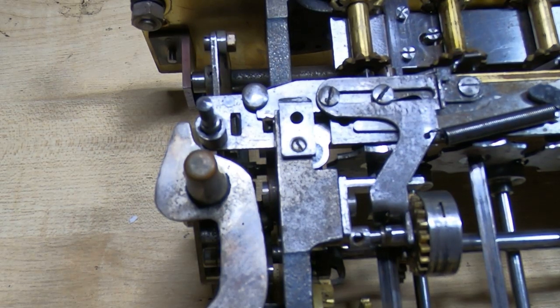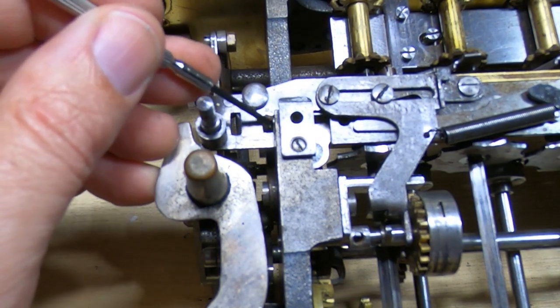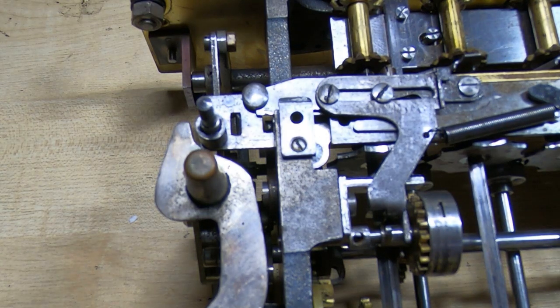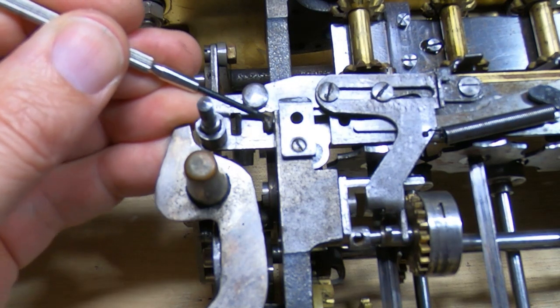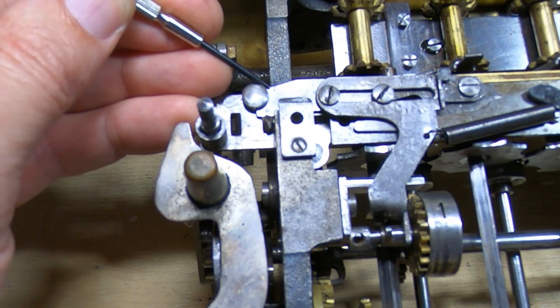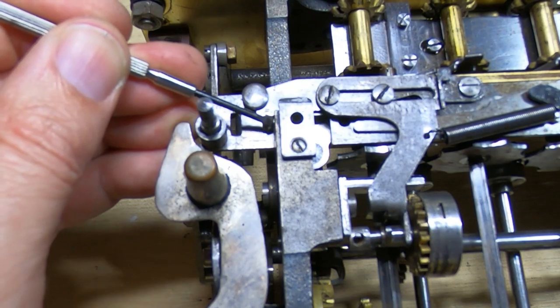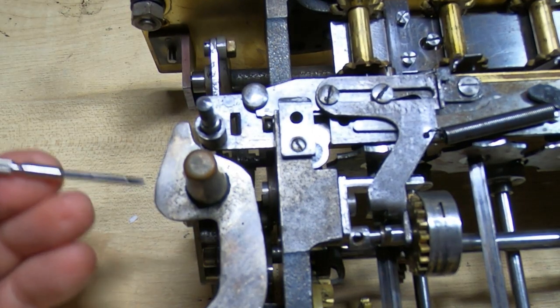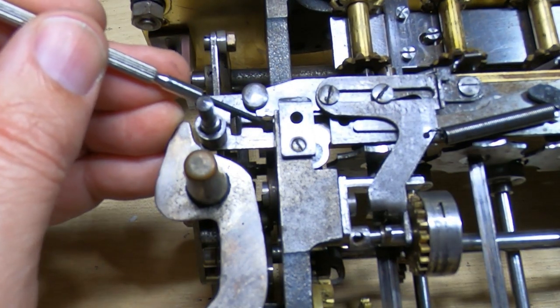So this time round it should terminate the operation - and that lever's gone back down, it's now finished cycling. I'm still turning the gear but the machine has disengaged, it thinks it's finished the division. I'll start it going again - if you're watching this hole you'll see the lever pop up initially. I push the button down, you can see the lever's come up but it hasn't come up far enough to allow this lever to move down into the slot. I think that's what's supposed to happen, so I need to find out why this lever isn't coming high enough - it might just be there's an adjustment required on the end.